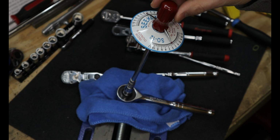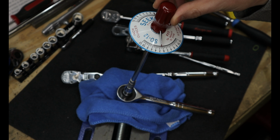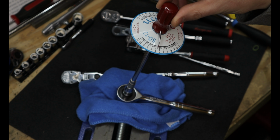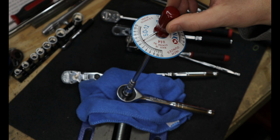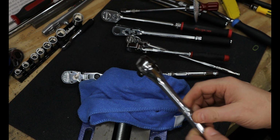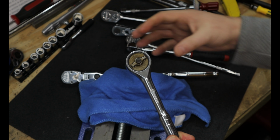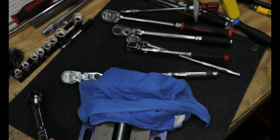So when it comes to testing out the gearless ratchet, you can see that we are right there with the Koken. 1 ounce, doesn't really peak out over 2. And that's why to me, that Koken ratchet is really, really superior when it comes to the internal size as well as the back drag if you were to compare it to a gearless ratchet.